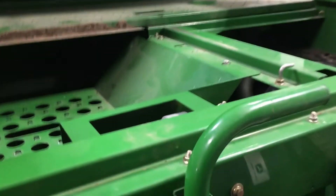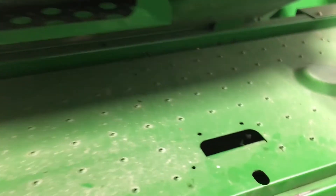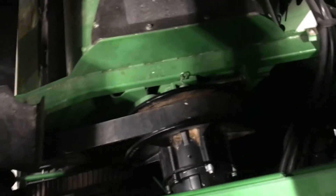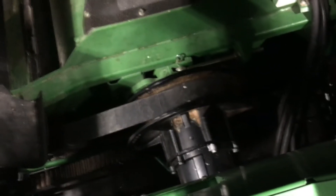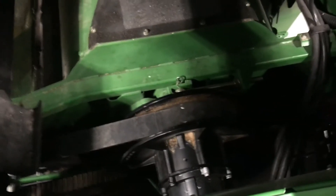As far as the engine compartment itself, I opened the top doors here. You would probably need to fold the grain tank extension down and get it out of the way so we can get this next door open. Crawling down inside there, we're going to get a good look at the front side of the engine — we're going to see our gear case and our variable drive for our rotor.